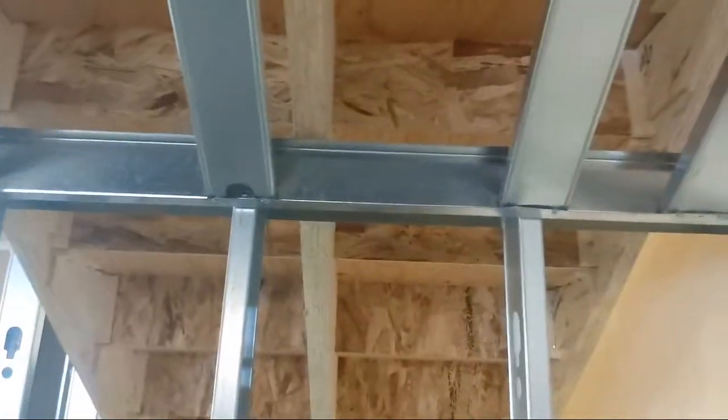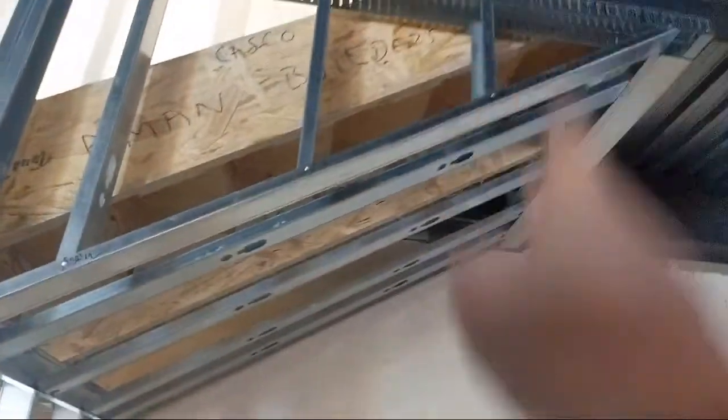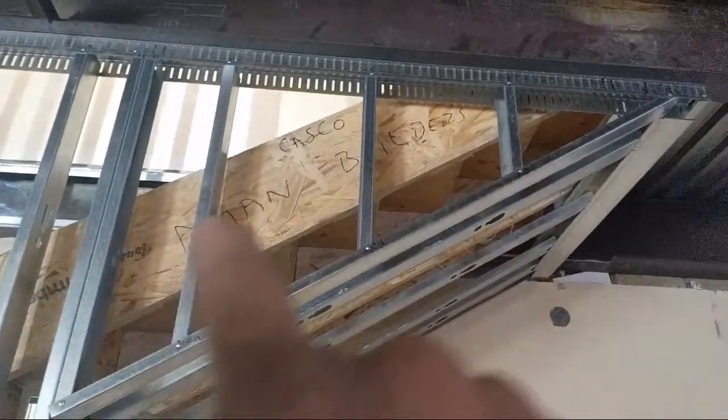Okay, I'll put the track going this way, and the track going this way, and then I'll put the studs in. After the studs are in, I straight bar across for this angle, the end angle here. I'm going to straight edge across and mark it. You can see I got a mark there and a mark at the top, so that the angle is straight. And at the end, I will straight bar this track as well. This last piece of track will get straight edged over, secured, and then I will laser in my stud marks, and then put those studs in at the end.